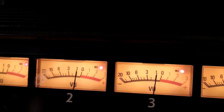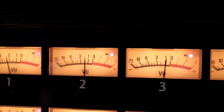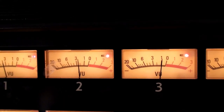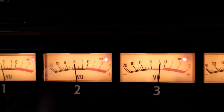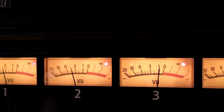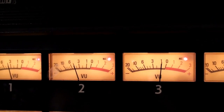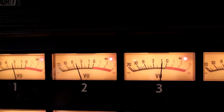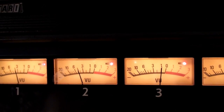That's what we want — you want it to fall back the amount your tape recommends. For the tape we're using, it's about 4dB of over-bias. So we're going to over-bias 4dB. We go back 4dB from the .5 hinge point — since negative .5 was our hinge point, we're going back to minus 4.5dB. That's right in between those two little marks there, so that's an over-biasing of 4dB.